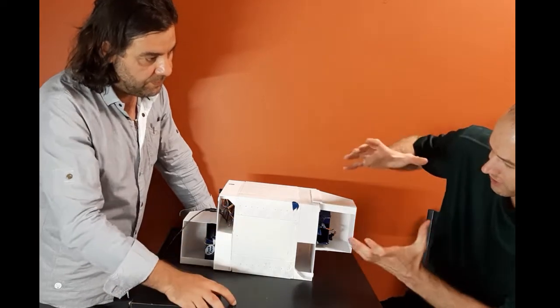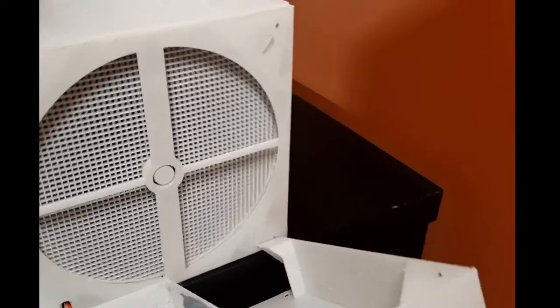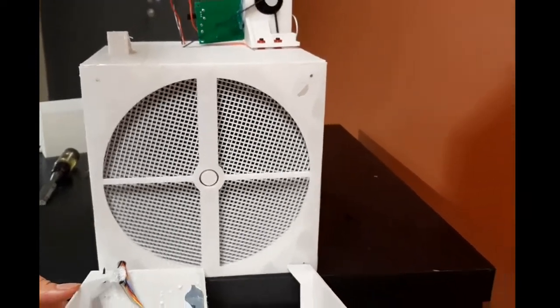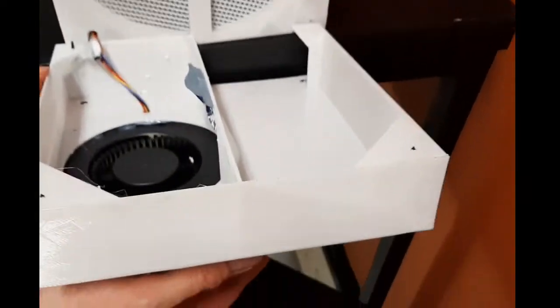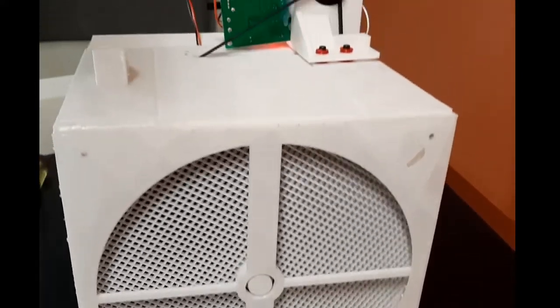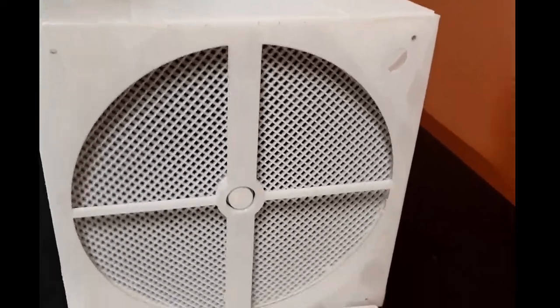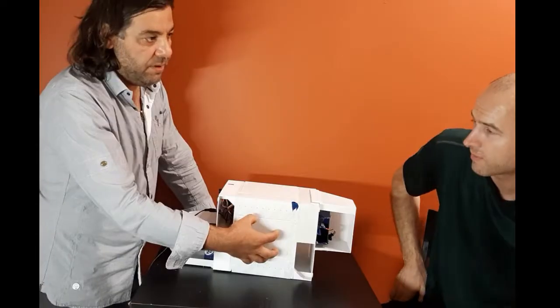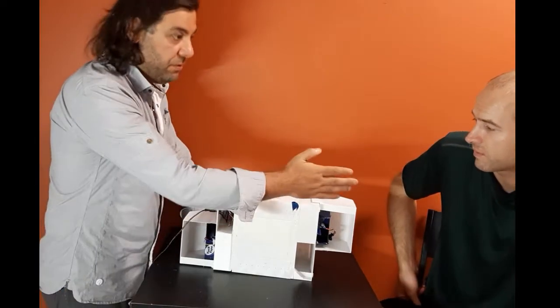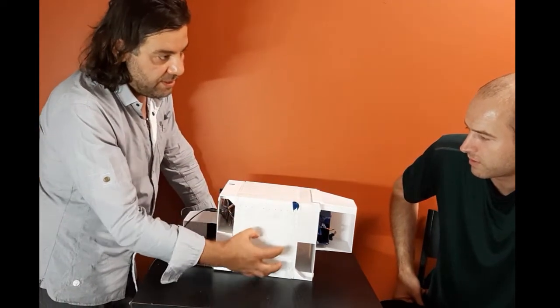Yeah, inside there's a cylinder which has a very large number of parallel flow channels. There's 4,100 straws, and each straw has at least 2 channels, and there's a channel between the straws too. So it's like 12,000 channels or something in there, about 1.5 millimeters in diameter. And so you can think of it as a very porous material that lets air flow through it easily in one direction, and then that material is the intermediary.